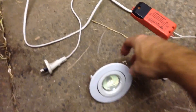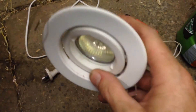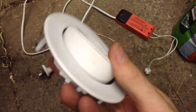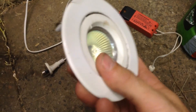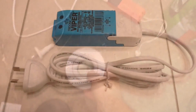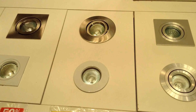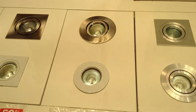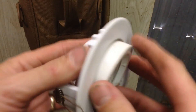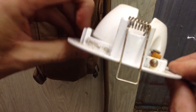So what you're going to need is this: there's the downlight, there's the globe inside, and that's what's called a gimbal kit. You can get them straight, or so that they pivot to get different angles. The globe itself slots in, then you twist it, and that's your gimbal set. A kit like this with a transformer and a straight or angled gimbal kit is about $20 to $30.